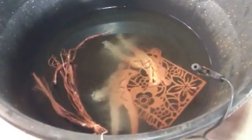After we plate, we have a container of what I call neutralizing solution, which is just baking soda and water. After we neutralize the acid with baking soda and water, we wash it off. And in order to keep it from corroding, we wash it, dry it, and then paint it with clear lacquer.